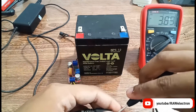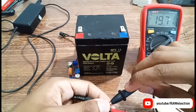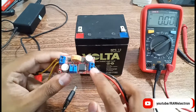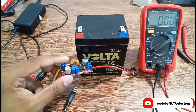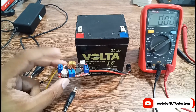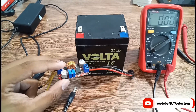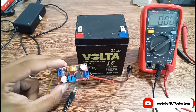The output voltage of the charger is 19.7 volts as you can see. I will connect it to the XL4015 buck converter. There are many questions about this buck converter — some people asked if you can give it 25 or 29 volts. Yes, you can — its input voltage range is 5 volts to 35 volts. It will provide a step-down output voltage.